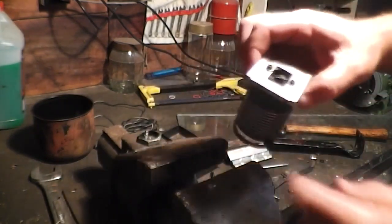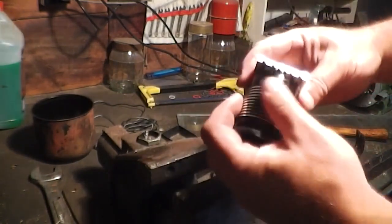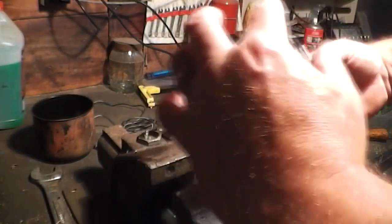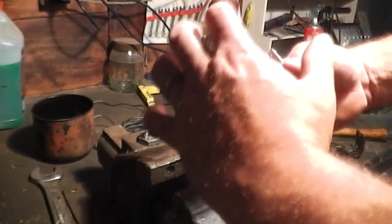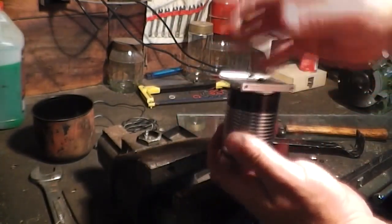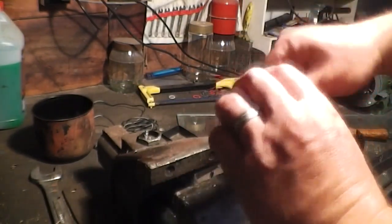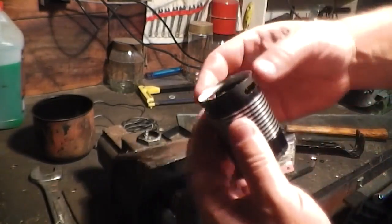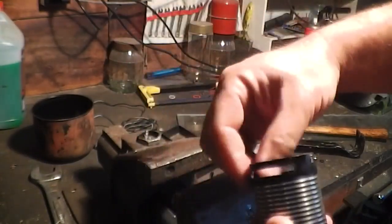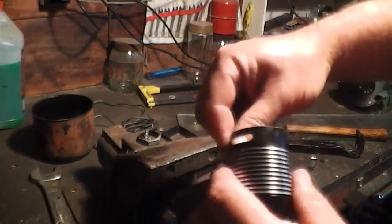When I loosened off my bracket, I worked out that I was going to be applying torque that way, so I put the slots right to the end of the adjustment and then did them up so there was nowhere for the bracket to slip on the motor. I'm going to clean all this out — there's quite a fine thread in there. Get all the old threadlock out. Obviously you want to be applying some more when you put it all back together again.